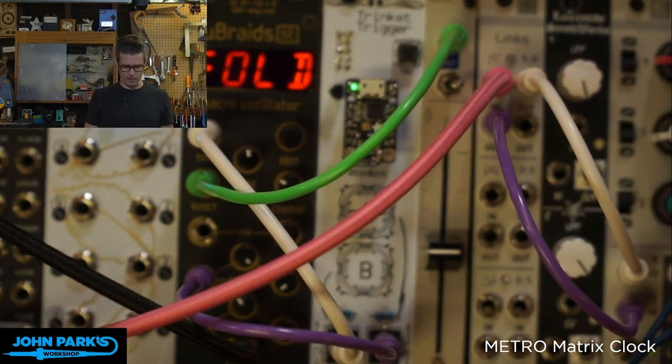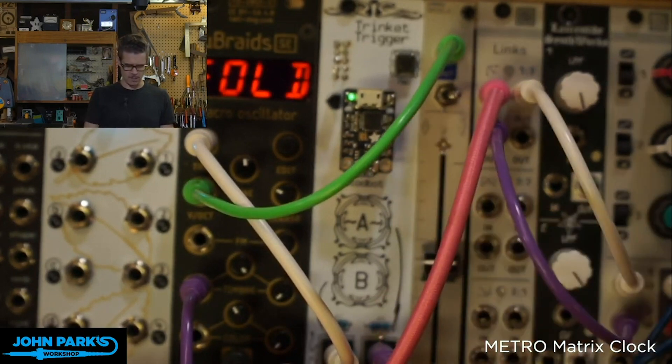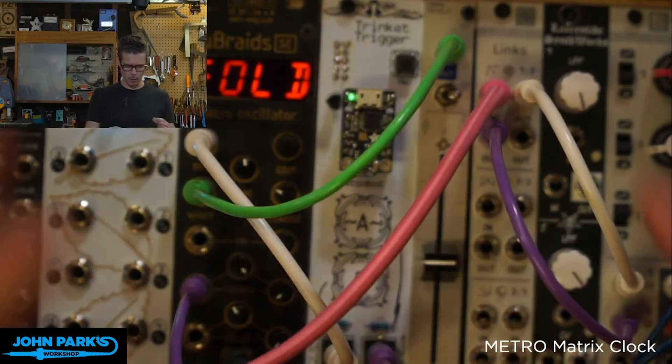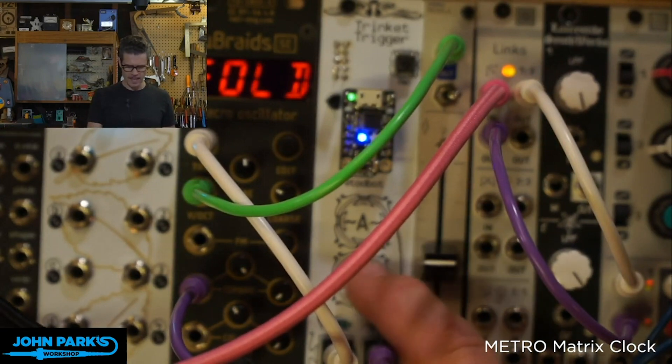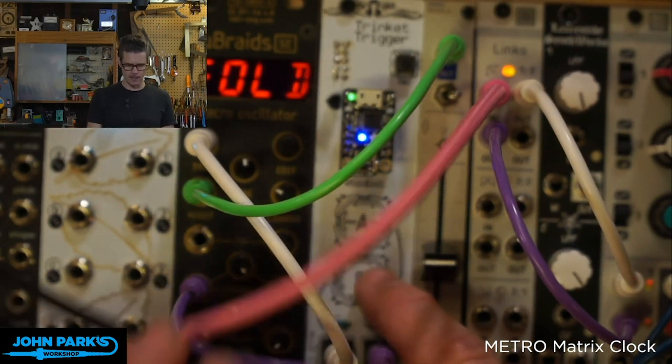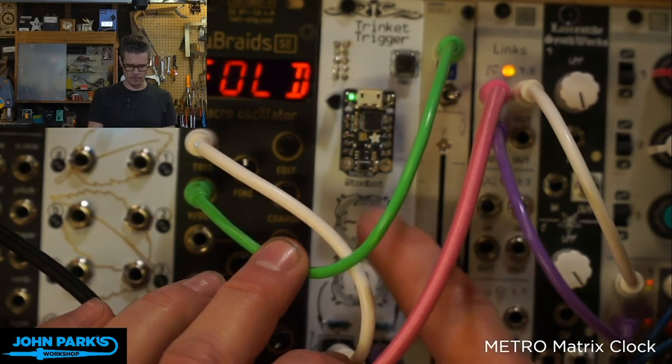B is used for sending a gate pulse, and A is used as a control voltage that can vary. How do you trigger them? These are capacitive touch pads — the B and A are using two pins in capacitive touch mode. So with this patched into other stuff, I can now tap B here, and you can see it's triggering. And I can tap A — that's triggering two different pulses sending out.